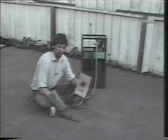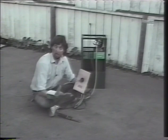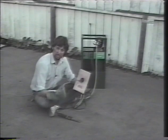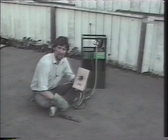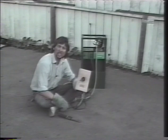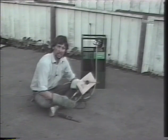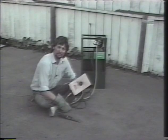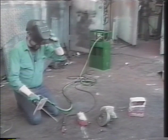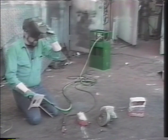Now, you've got to remember, if you're going into safes or some area where there are valuables involved, it will burn money, it will burn anything else as fast as it burns steel or faster. So you got to be a little careful with it. You can relock locking devices, fuse relockers together if you're not careful. But it is so much faster than drilling and so effective that it's pretty close to magic. Let's see, I'll show how fast it goes through a piece of 1-inch thick steel and hard plate.